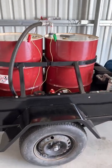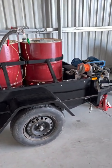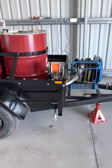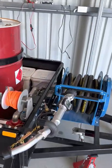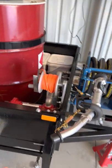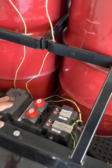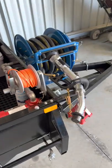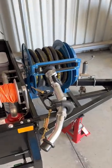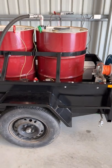We finally got it working — took a fair bit to work out because it's a fairly small space while keeping within the 750-kilo weight limit and making it functional. The entire operation is driven from this side: the hose reel, the static reel, the drain, the pump switch, and the isolator. You'd have your aircraft on your right-hand side when you park next to it. It's a 10-metre hose on that reel — you don't really need much longer than that. There you go — new Avgas trailer.